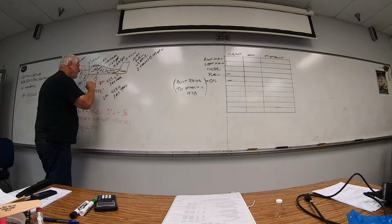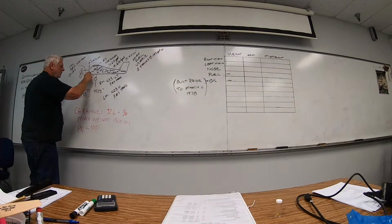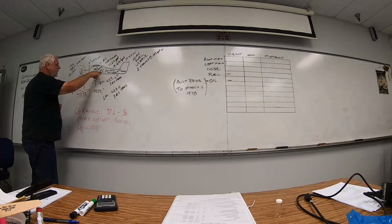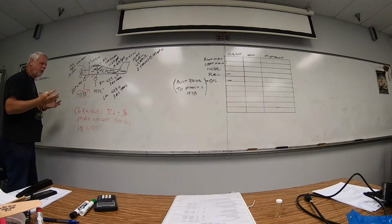Make sure you can see that. Front seats, 2 of them. It's a Cessna 150, so it's only a 2-seat, unless you have a baby seat in the back. Who would have thought that? So front seats, 2 at 39 inches. That's going to become important here in a little bit. We're going to do an adverse weight check.